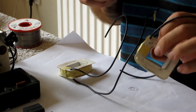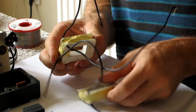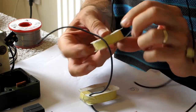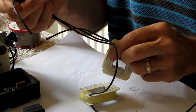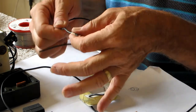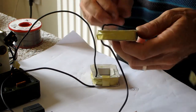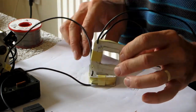That's the two coils wrapped in special electrical tape. Now what I'm going to do is terminate them with some wire as before. That's my first coil finished — now I just need to remember which way around this is wound and mark these wires up so I know which way they go. I'm going to mark start and finish on the former. I've now got both coils terminated and both of them are completely insulated with tape. I've got my termination wires, I've marked the inner and outer ends, and from my point of view I think it's final assembly time.